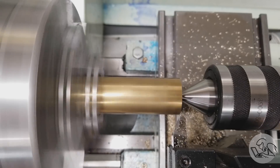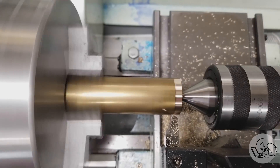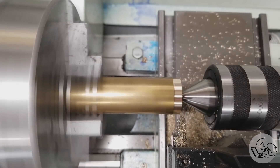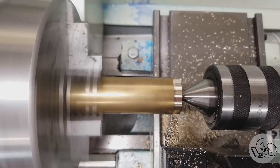The ability to create concentricity as if from nowhere is really the magic power of the lathe — check out my video on concentricity for more on how that works. Now you can see we've got it running well with the center: no vibration, but you can see the runout on the surface. I'm taking a series of light passes just on the end to figure out how deep I have to go to get that bend out. Once I've got a clean pass all the way around, I can come back and turn the full length at that depth.